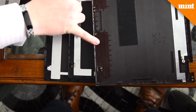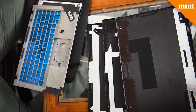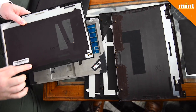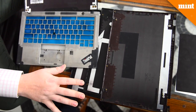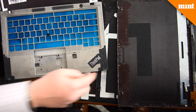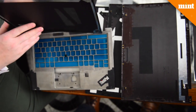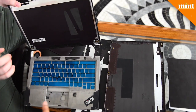We use glass fiber reinforced plastic for the radio antennas and for the structural lip. That's what lets us make the bezels thinner, because you place them differently. But whenever anybody says 'why can't you just make the bezels thinner?', it requires a complete redesign, which is what we had to do for our X1 Carbon. This is an unpainted shell of the new X1 Carbon — you can see a slightly different type of material in various spots. That's 9 to 10 years of expertise in hybridizing materials.